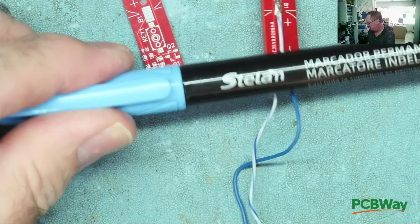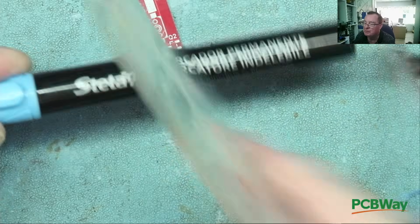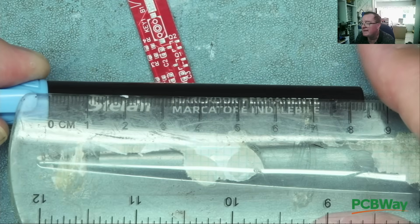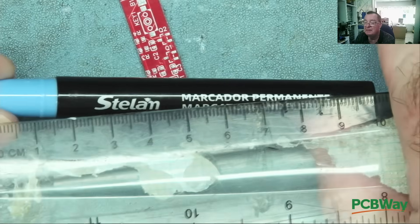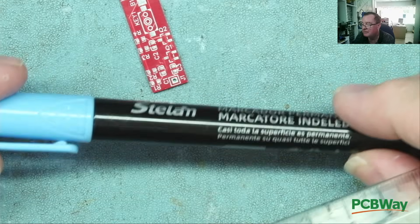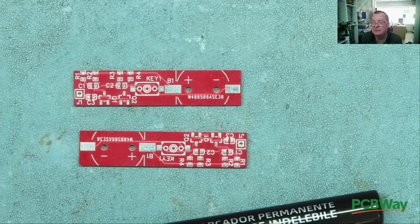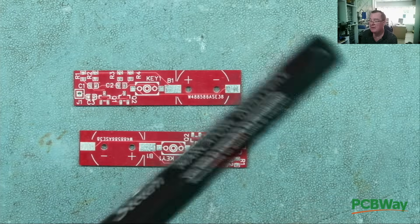How wide is it? Let's have a look - just over a centimeter, 11 millimeters. But bear in mind the plastic has some thickness. This one has about 8 centimeters of length, maybe a bit more, so you might have quite a bit of dimension to work with - that might help you with the battery design. The button can be wherever you want, but it must be able to be assembled by hand. Whoever comes up with the smallest will get the PCBs made by PCBWay.com.